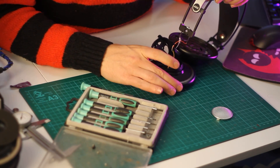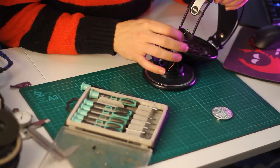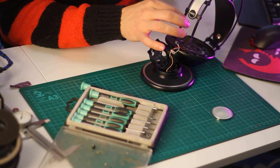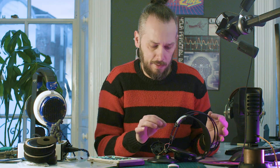Here's one of the weird things about these headphones. Most headphones will have a wire that goes over the headband to the other ear. On these, they actually use the spring steel of the headband — the wires are soldered onto the metal parts of the headband which carry the signal over to the other side. You might wonder if that's going to be good for the signal, and it's probably fine because this is a big thick bit of metal — it's going to be very low impedance. It's quite a novel, clever solution that no one else has come up with.